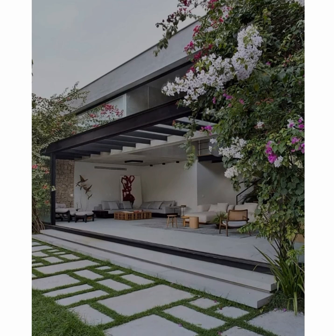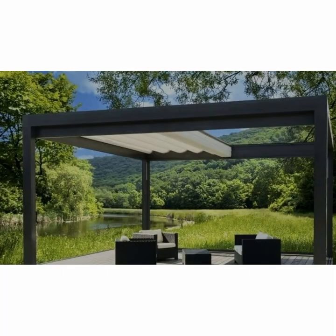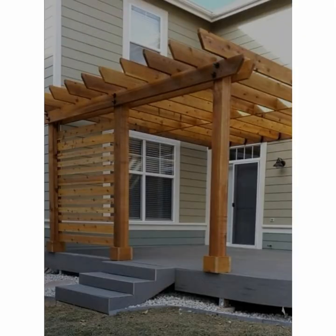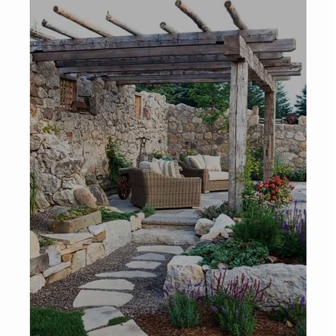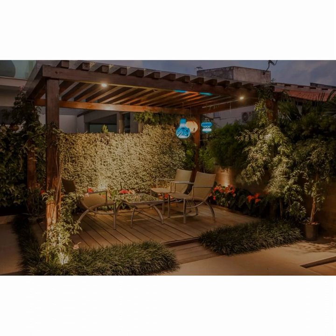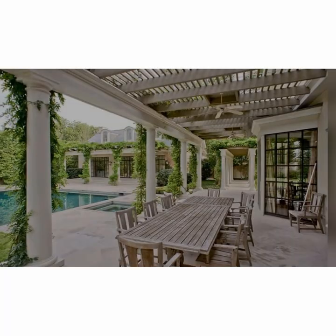You'll also need a shovel to widen the hole. Dig until it's at least 24 in. deep. Step 3 — Measure your soffits to determine the column centers. If building close to the house, first measure the projection of your eaves. Keep the center of the posts nearest the house at least 7 in. farther from the house than this measurement. Drive remote stakes an equal distance from the house, attaching a string to help mark and align the outer post locations. With the stakes driven beyond the work area, you'll be able to undo the string while you dig and reattach it later to check alignment. To make sure the layout is square, adjust the diagonal measurements of the post holes so they're equal.